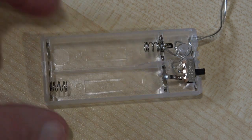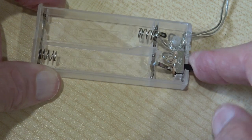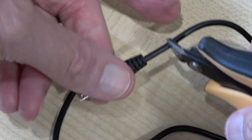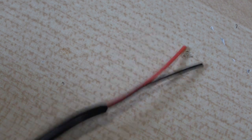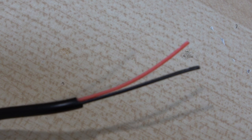Here is the battery compartment, where the AA cells go. It's got an on/off switch on it, and that's basically all. We should retain this on/off switch. The first thing we need to do is set that to one side and get a USB cable — what's on the other end is largely irrelevant, so we cut that off. Some USB cables will have four wires inside, but the majority simply have two, and they're hopefully colour-coded the same as this: red and black, with red being positive and black being negative. So we need to strip the ends and tin them.